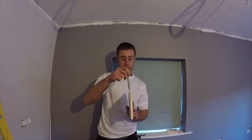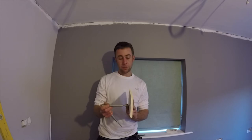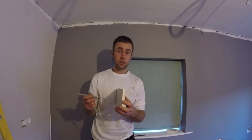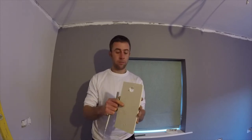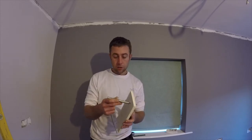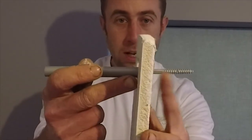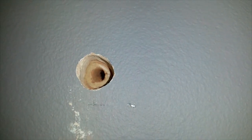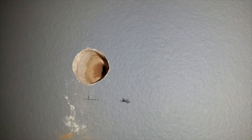Okay, so one other thing to bear in mind is this wall, it's got plasterboard, then 2mm thick plaster skim coat all over a brick masonry wall. Say this is the wall behind here, there's your plasterboard. So if I screw in there, I've instantly got about 15mm less of the screw going into the wall plug, which isn't good. So what I suggest, and I've slightly over-egged that hole, to be fair, is you drill the hole in the masonry first, and then you use a hole cutter, just a timber hole cutter would do, on the end of your drill, just so that this bit can pass through and hit the wall on this side. It just gives it more support, especially if you're doing one like this and the shelf can be quite heavy. And there you can see the smaller hole going through the masonry behind the bigger hole for the plaster.